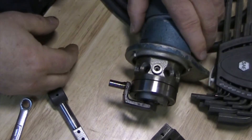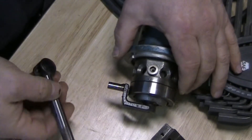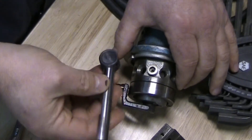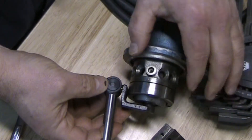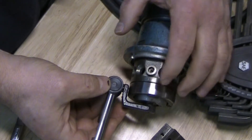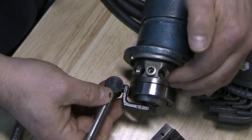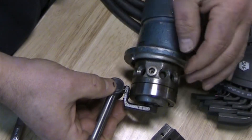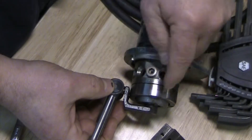We're over here at the bench. I've got the motor side of the scraper here and the articulating head of it. You've basically got this rod here that the scraper shoe rides in — this is the linear part of the motion, the receiving end of it. That fits onto this pin here. This pin is connected to an arm, and this mechanism on the inside is basically a swash plate. A swash plate is the same thing that makes an articulating rotor head on a helicopter work — it's basically a disk that has followers on both sides. One follower is influenced by the socket head cap screw here.